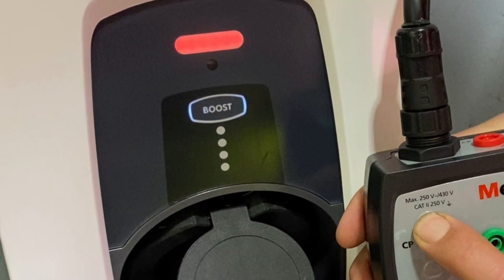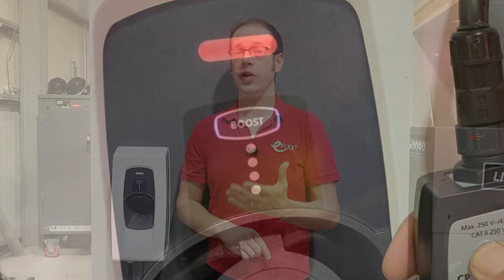When the primary LED is lit up in solid red — not flashing — it means the charger is in a permanent steady-state fault mode, which indicates the unit has encountered a major error and needs a hard reset, achieved by disconnecting the supply to the charger and reinstating it. The easiest way to do this is to operate the MCB or RCBO feeding the charger off and then on again.